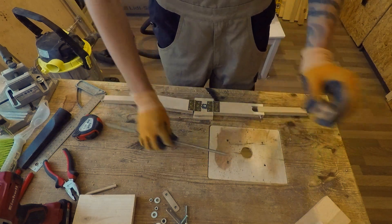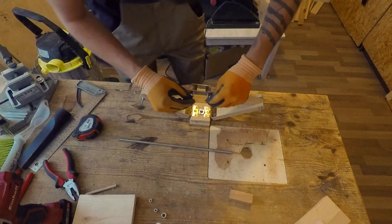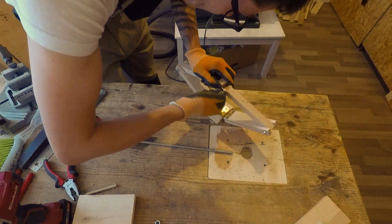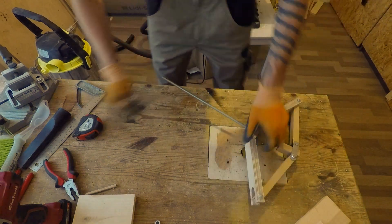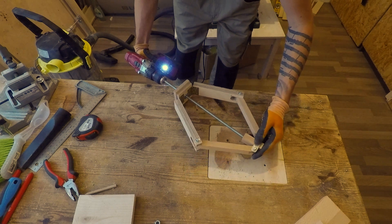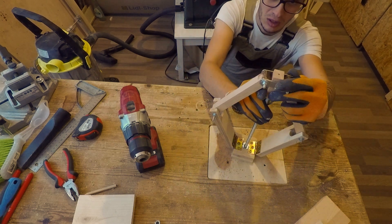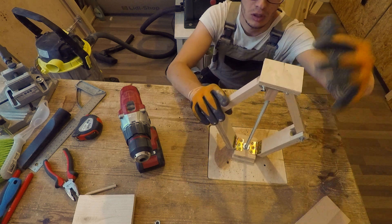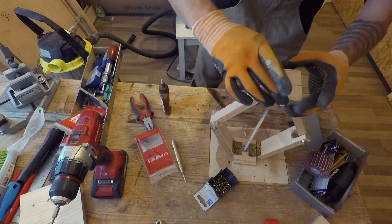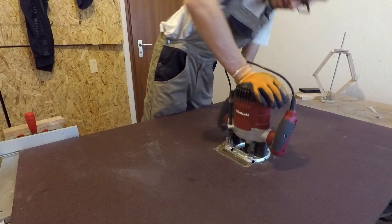I have also prepared a small piece of hardwood that will rest on the head of the lifting screw and will be fixed to the top of the lift. The small hole in the wood is just to avoid the lifting screw drifting. Now let's put the lifting screw in its place — I will use the drill just to make it faster. I will also add a small piece of wood between the lift and the router, and lock the router in its maximum lifting position.